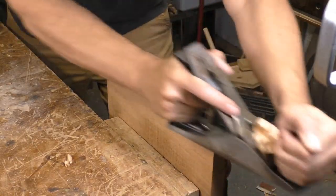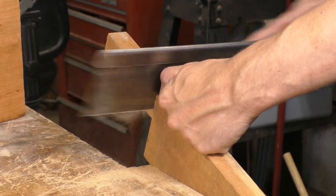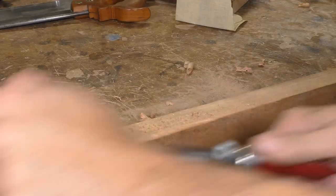For fine furniture I go directly to category two: easy-working hardwoods. These are woods like cherry, walnut, soft maple, and poplar — familiar names if you've done any woodworking. These woods are popular for cabinetry and fine furniture because they're hardwoods but on the softer side. More importantly, they're diffuse-porous woods, meaning the pores — the veins that take nutrients around the tree — are scattered evenly and are very small. That gives the wood a very even texture, a fine finish, and makes it unlikely to splinter or chip.